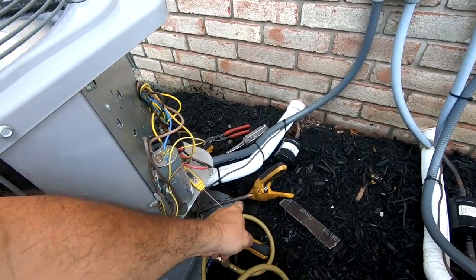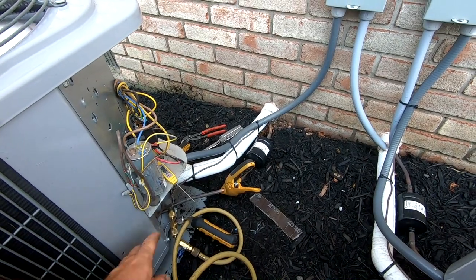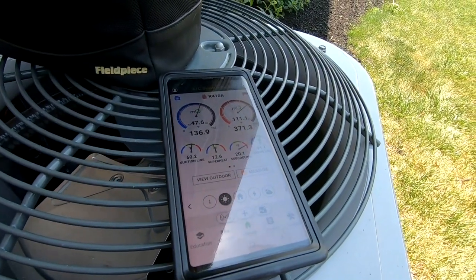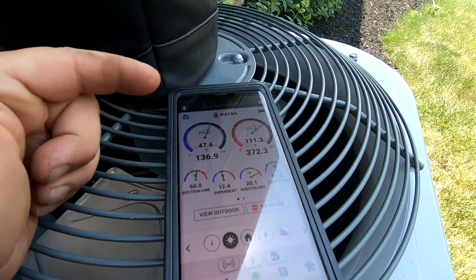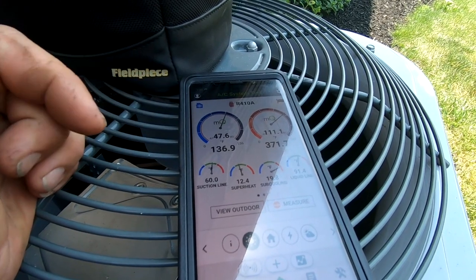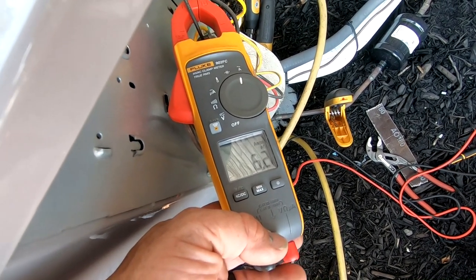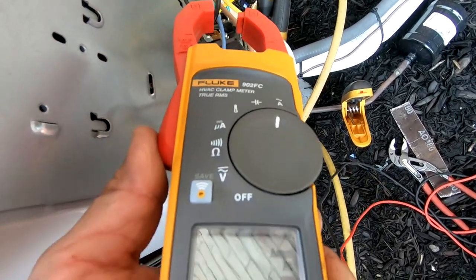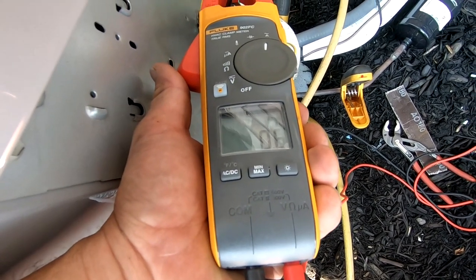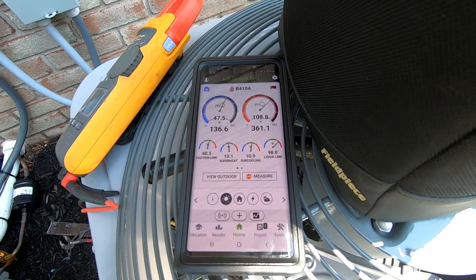One thing I want to mention — I sanded both sides of my filter dryer. First thing I did was check a drop across that, and I had none. Usually they say up to 3 degrees. Pressures are looking a lot better. You notice we're not seeing a lot of swinging on the high side or even the low side. Generally, when it's massively overcharged, you'll be swinging up and down. I didn't check the beforehand amperage, but the compressor's at 6.1 to 6.2, which is pretty good. And the fan is rolling right in there at 0.5 to 0.6. We're going to let it stabilize and go ahead and take our temp drops.